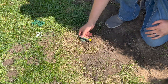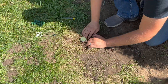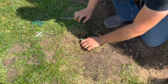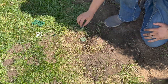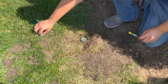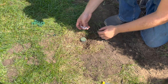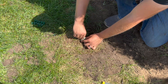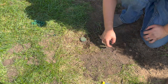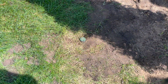To adjust the rotation, I spun the top of the head clockwise until it stopped to find the starting edge. There is an arrow indicating the direction of the sprayer, and you'll have to turn the base of the sprinkler to make sure that the starting edge lines up with the right side of your spray pattern. With the right edge lined up, I rotated the head counterclockwise and used the arrow to identify where the spray pattern would end. Using the adjustment tool, you can tighten the rotation screw to increase the rotation or loosen to shorten it. You'll want to rotate the head completely back to the right every time you make an adjustment to check where the new end point will be before starting the system to make any final adjustments.